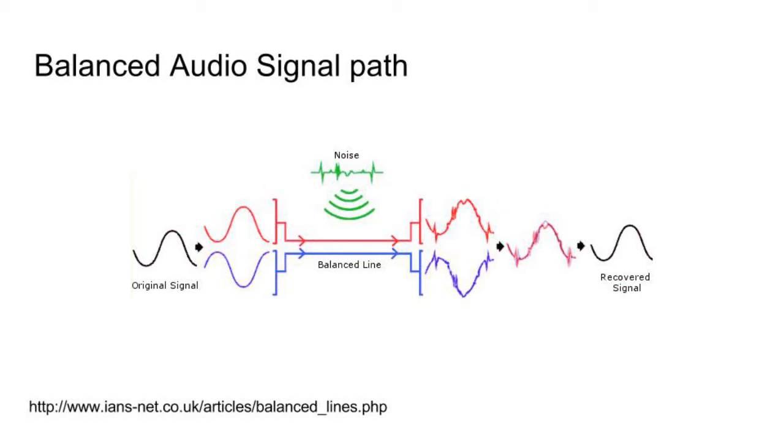How does a balanced line work to remove noise from the signal? Balanced lines achieve this by transmitting two versions of the signal down the length of the wire. The source equipment sends the normal signal down one conductor, usually called the HOT, and a polarity-inverted — or phase-inverted — signal 180 degrees down the other one, which is called the COLD. This is usually done using either a transformer, as in our DI box, or electronic output stages. The cable itself is designed with the conductors having very similar impedances and twisted along the length, so that any noise is picked up equally by both conductors no matter where in the cable it occurs. The receiving equipment has a transformer or electronic differential amplifier and takes the inverted signal and returns it to original polarity.